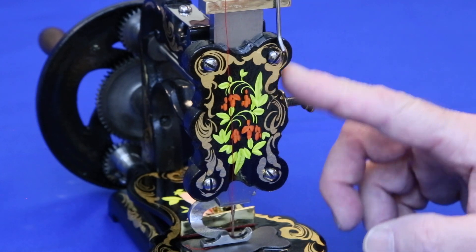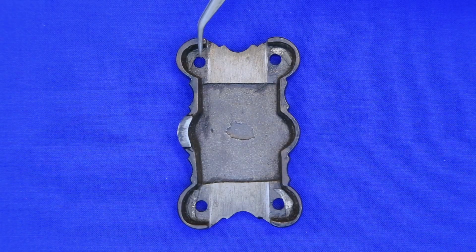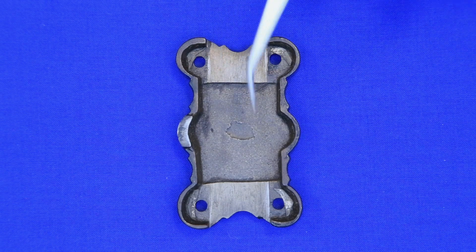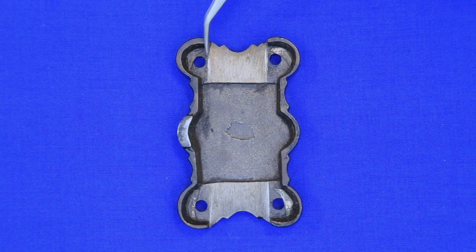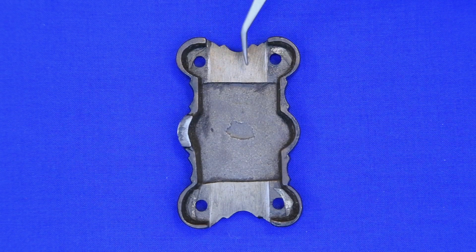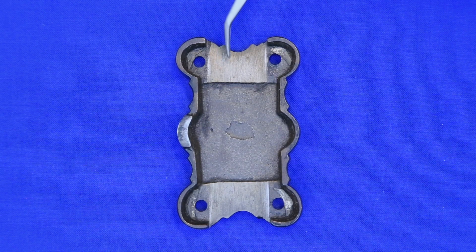The last item will be of particular interest to anyone wanting to take one of these machines apart, and it's hidden under the end plate. When I removed it for restoration, I noticed there were thin metal shims under each of the four corners. These are needed to provide enough clearance so the main armature slides freely up and down. Without them, the armature would rub against the end plate. I don't know if these shims are commonly used on this class of machine or if a mistake was made in machining necessitating their use in this particular unit. Either way, these shims are evidence that these machines were made in an era of file-to-fit manufacturing.